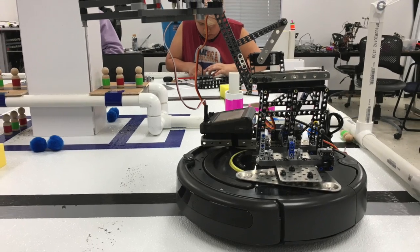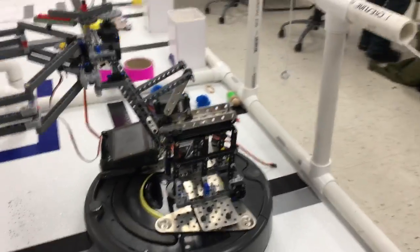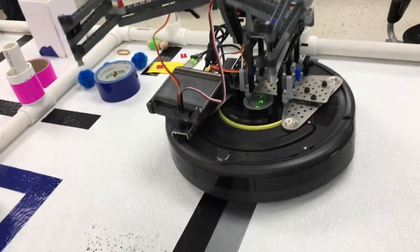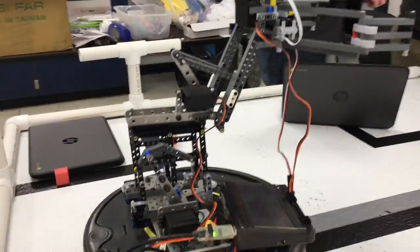The claw assembly is composed of a gearbox mounted atop the main chassis. This chassis holds a servo that has a 40 tooth gear connected to a 24 tooth gear, which moves the two sides of the claw. The end of the claw has a top hat sensor attached, which is used to determine the distance of other objects.